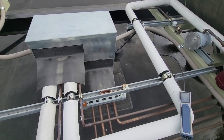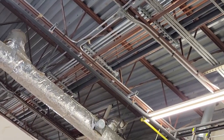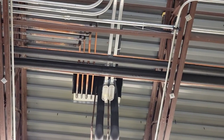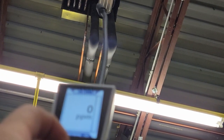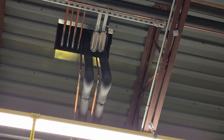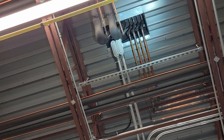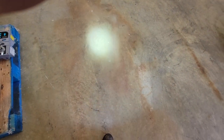I have no way of getting up that high without a lift. There is where that comes down — you can see it comes across right there. So if we were cranking out refrigerant, you would think we'd pick something up. I don't — all I can do is put a straight ladder up there, which is not really the safest thing in the world. You would think if we're leaking bad, it would drip and you'd have some oil down here, something. Because it looks like it's leaking pretty quickly on the computer graph. But I think it's slowly gotten low and then it did its thing.